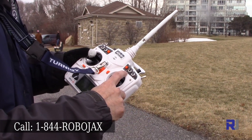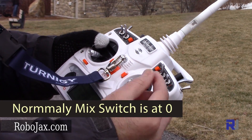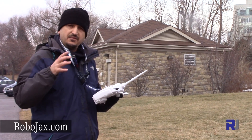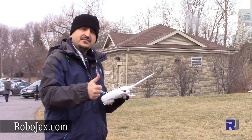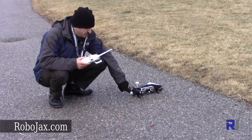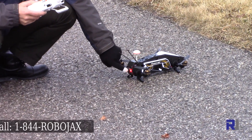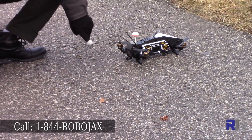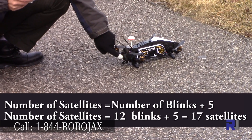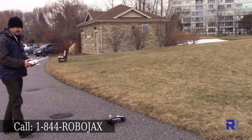When we fly, this is the mix button on the Devo 10 transmitter. Pressing it to position two initiates return home. There are two important conditions: first, there should not be trees or branches in the way; second, you should have a minimum of 15 meters altitude above the ground. Until we see the blinking light for satellites we cannot use the return home feature. Now the light has appeared — we have twelve satellites, so we are very good. Let's do a flight — I'm arming the drone.